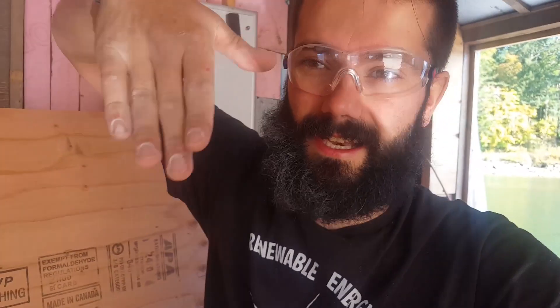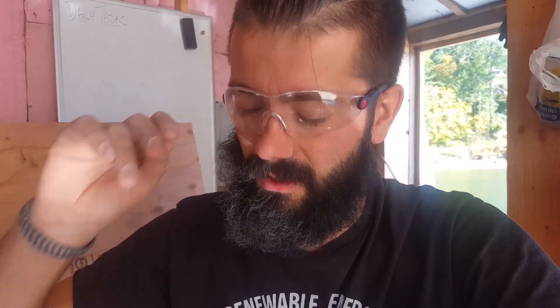Since I haven't been doing such a good job at filming — this is kind of messy work and epoxy fingers and cell phone filming don't go hand in hand so well — I'm going to explain what I've done. Basically, we're building a floor and building pockets to hold it. The general premise is if we keep the floor in the pockets and not epoxied to the actual hull, it could still allow the Warram to do its flexing. When this thing is in heavy conditions, comes off a wave and slams into the other side, some of that concussive force is transmitted to the beams, and it allows the hulls to flex ever so slightly from one to the other. You can really see it when you stand on one side of the boat going through waves — you can see the other hull is just barely moving a little bit off from the one you're standing on.